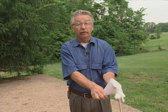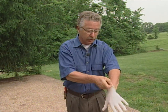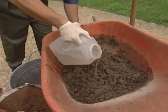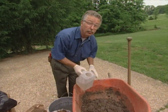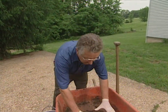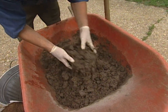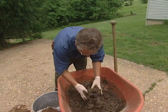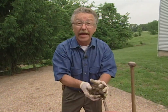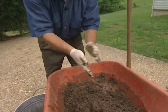I've gotten some disposable gloves — this is to protect your hands from the Portland cement in the mixture. At this point, we want to trickle in a little bit more water. We're looking for a thick, lumpy paste, and it's remarkable how much you can change the consistency of this material just by adding a little bit more water. Once you've got it to a thick, lumpy paste, we're going to take it and shovel it right into our mold.